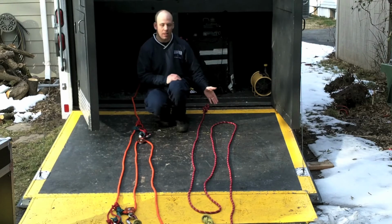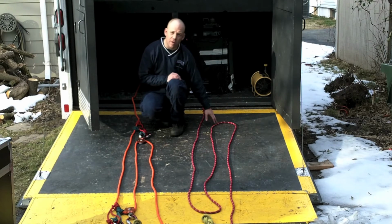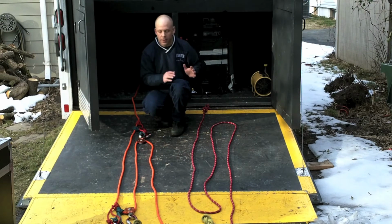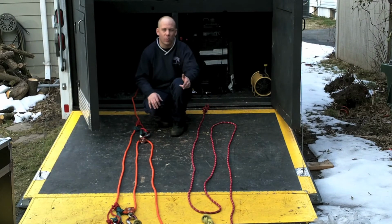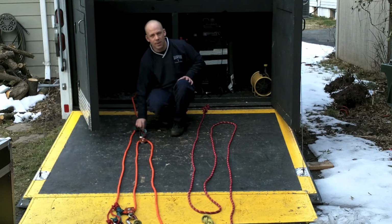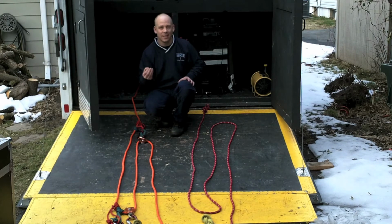If you look at this outline, it takes the shape of a Z, thus Z-rig. There's a curve up here and a curve down there. They look round. What do we have that's round? These pulleys. Clue number 1. Round pulley, okay, done. Now, we're working with carabiners, and that connects our hardware to our rope, to our anchors. Those are our means of connecting things.